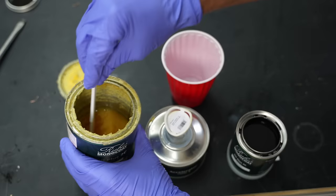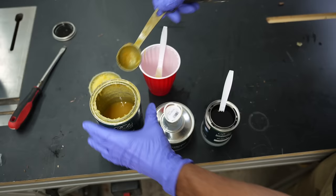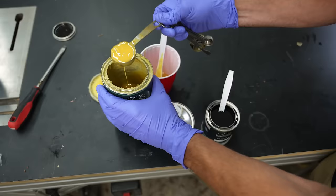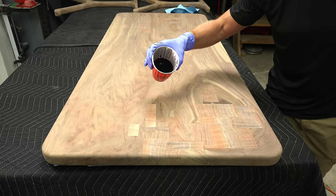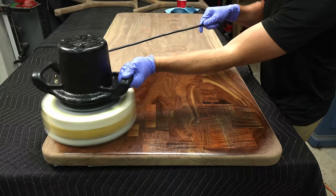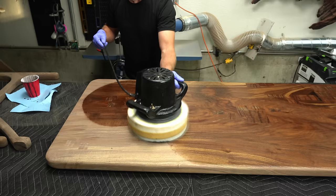The finish process on this one is a little bit tricky since the patches came from a different tree than the main slab — the colors likely wouldn't match very closely. I hate staining things; I think stain generally mutes the colors and really hides a lot of the wood figure and grain instead of enhancing it. For this I did half Rubio Walnut and half natural — basically diluting the Rubio Walnut stain, which isn't really a stain. You can see it evened out all the colors without hiding very much. I still prefer natural Rubio Monocoat on almost all my tables, but sometimes you really need to blend different woods together, and this is a really nice subtle way to do that.